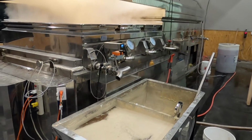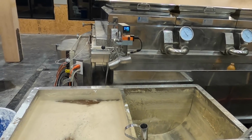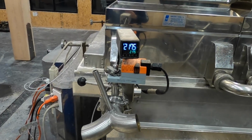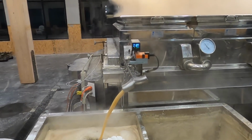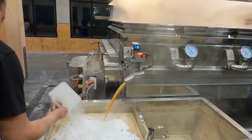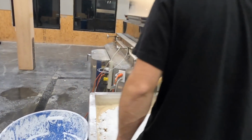The syrup then comes out of the front pans through this modulating draw-off valve. The valve opens and closes depending on how hot the syrup is. The hotter it gets, the more the valve opens. The syrup cools down and it closes. And after it comes out of the evaporator, it winds up into this tub where we add filter aid powder that you mix in with the syrup.